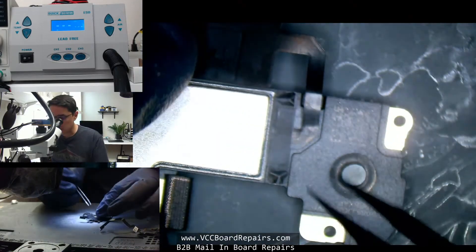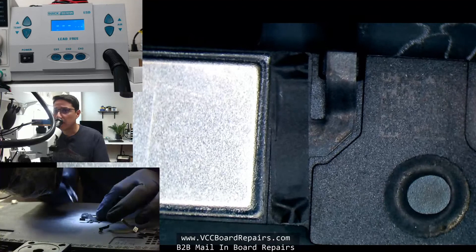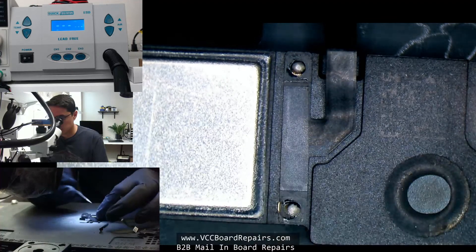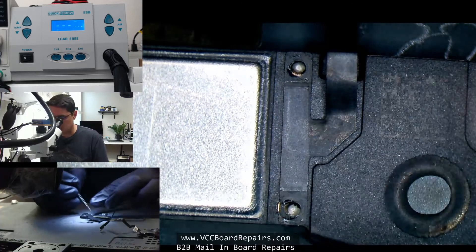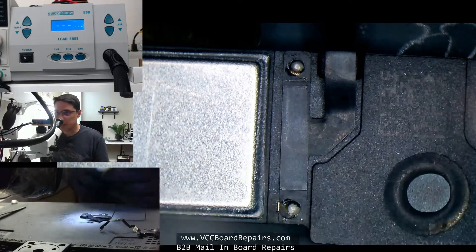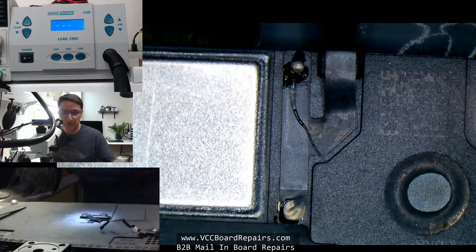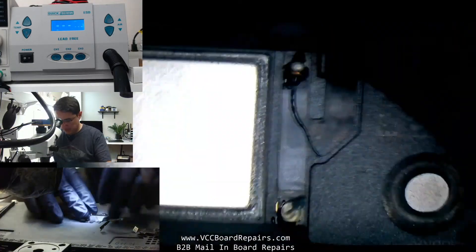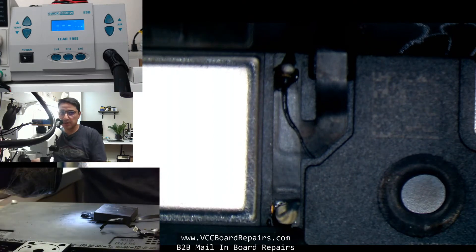Get the speaker you're going to work on — let's assume this is the bad speaker. There's usually a little sticker here over the part that is soldered, so just use some tweezers to peel this off. You don't technically need to save this sticker. As you can see, there are literally two solder joints. Get your flux and put a little dab of flux on each joint — you don't have to put too much. Then I'll put this little steel block to hold the speaker in place so it doesn't move around. You can also tape it to your bench.